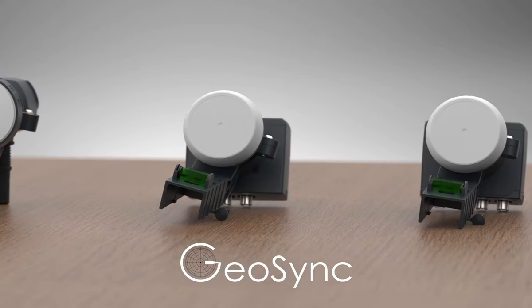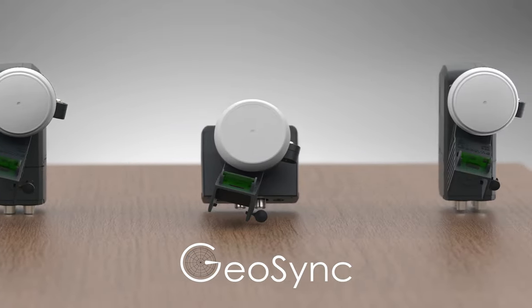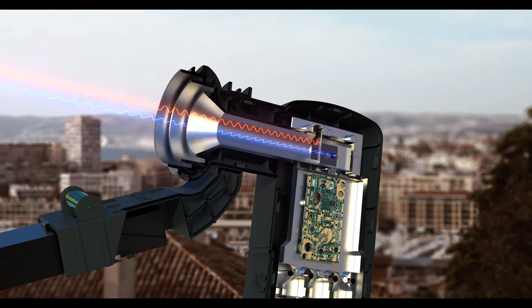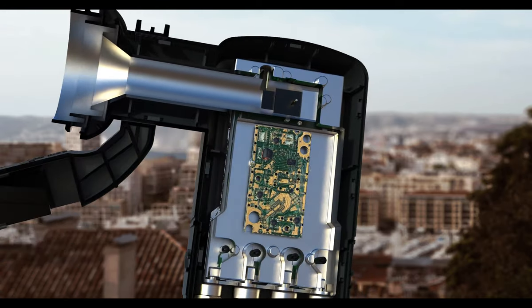What are the different types of LNB currently used in the UK for satellite TV reception? An LNB sits at the front of a satellite dish and receives two sets of signals, horizontal and vertical. It then down-converts the frequencies, amplifies and filters them to send to your receiver.